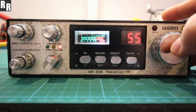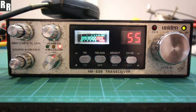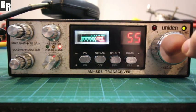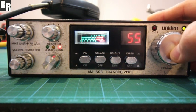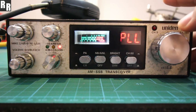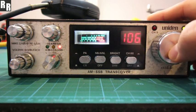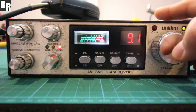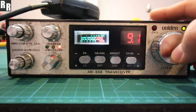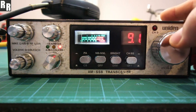That's pretty cool. To disengage split RX/TX, just press once and it'll let you know it's off. Then finally, the setting of the Digimax Lite is a 4-button press — PLL type: 106, obviously the MC145106 PLL because that's why the adapter board. Encode stays the same with all these radios that use a 15360 local oscillator against the 10.695 IF — it's always 91, because that's just the maths for the antenna to be 26.965 at channel 1.